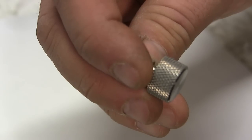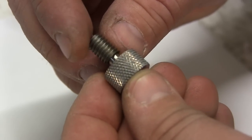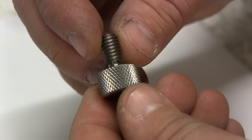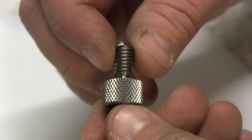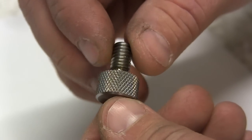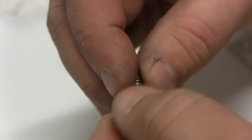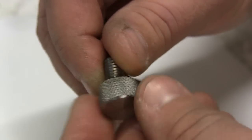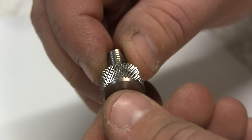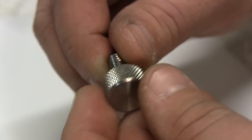Now, I really can't say enough about this knurling tool. I mean, the quality is there, and just the scissor type, the clamp type itself, it doesn't put any kind of strain on your lathe, on your lead screw. Looks like it came out of the Starrett factory, if you ask me. There's no cross tracking on it. There's no bent points.